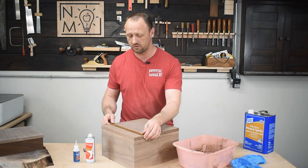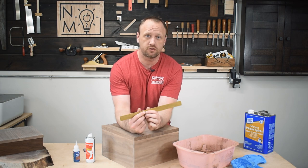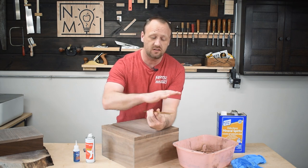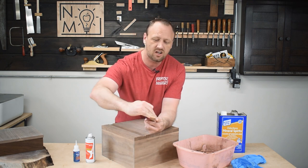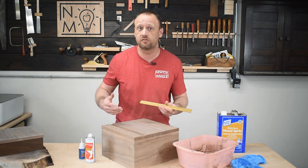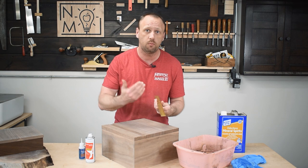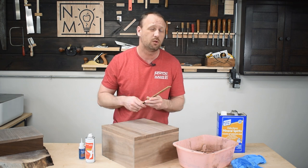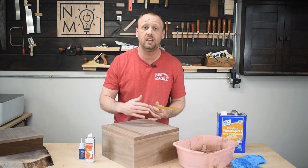This brass looks super cool, so now we've got to prep it to actually stick it into the box. First, I always like to clean it with some mineral spirits — it gets all that dirt, grime, and grease off. Once it's clean, I like to hit it with some 120 grit sandpaper and scuff it all up, and that's going to give us something for adhesive to stick to. The adhesive that works best for me is CA glue — it dries super fast so I can move on with my project. You've got to do that prep work: clean it off and scuff sand it so the glue has something to stick to. I've never had a problem with brass, aluminum, or other metals delaminating off the wood, even when it expands and contracts.